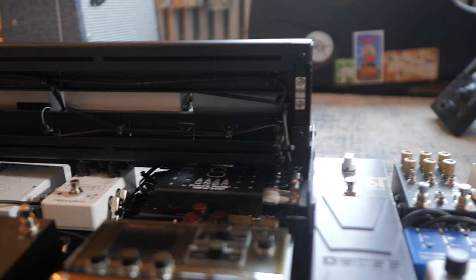So that was a brief lesson on why a balanced signal is important, but as I said, it's probably not necessary for everyone. If you've never had an issue using a TRS to XLR cable, just stick with that — don't waste money on something you won't benefit from. However, if you play a lot of different venues, eventually you're going to run into a situation where there's a difference in power between the stage and the front-of-house system, and that can reveal itself in a ground connection issue where a ground lift switch is going to be really valuable. I play with a lot of different artists, and if I'm backing up a well-known singer in a mid-sized club, even if they've got quality DI boxes available, if I run into a ground loop issue I don't want to be the one holding up the sound check. Having a direct box on my own board ready to go is worth it to me.